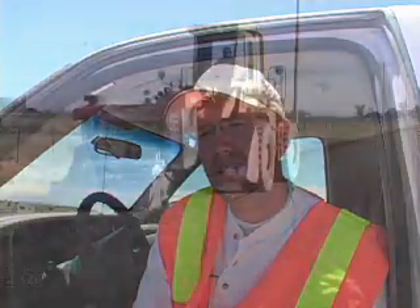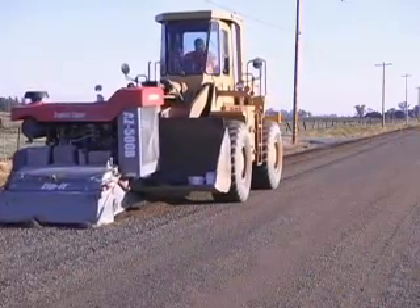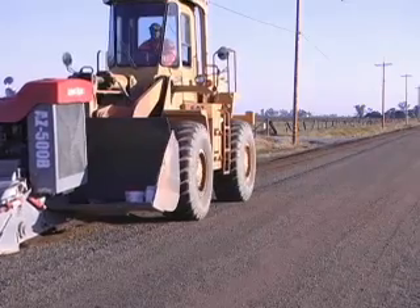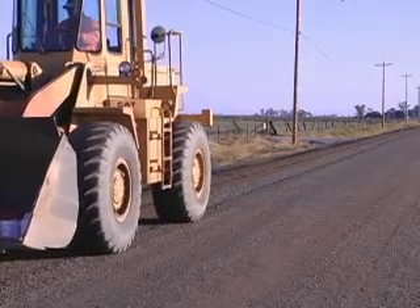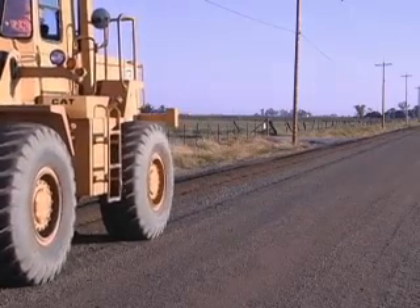When we had the AZ 500, we used it on a project. We have a lot of oil shell in our county on some of our gravel roads. We set it about 12 inches deep and kind of dragged that butt end of that zipper down. We were able to get about 14 inches of depth on that and go through that gravel oil shell. We did three miles of that. It cost me roughly $14,000 when I put all the costs together.